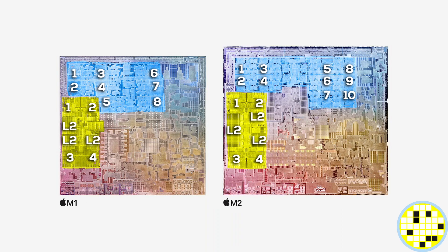On the note of groundbreaking, let's take a look at the Neural Engine. Apple is talking about a complete redesign with a 40% performance uplift, while still using a 16-core network. On the M1, the Neural Engine sits right next to the performance CPU, with all 16 neural cores clearly visible. When we compare it to the M2, we can see a pretty substantial change in the design and layout of the Neural Engine. The M2 die shows two tightly packed clusters with eight cores each, and the cores themselves also look a lot different to the old Neural Engine on the M1. So Apple's claim of redesign is very apparent on the chip itself. It's obvious a lot of work went into this new Neural Engine, and it looks more tightly packed too. I'm curious to see how Apple approached their redesign and if we will see a similar focus on the Neural Engine in the upcoming A16 chip.